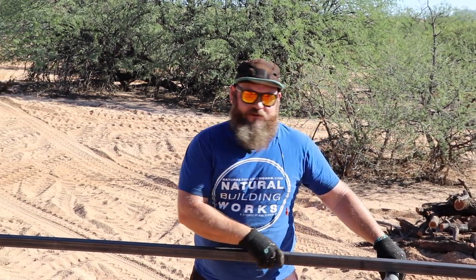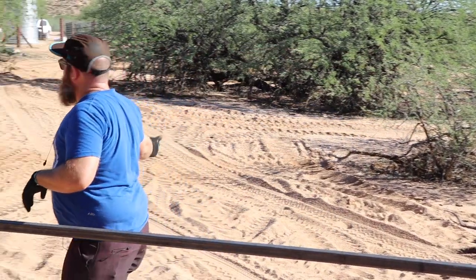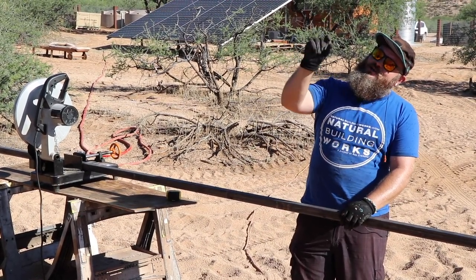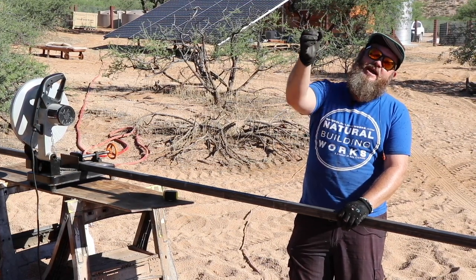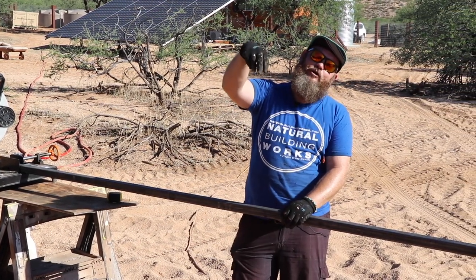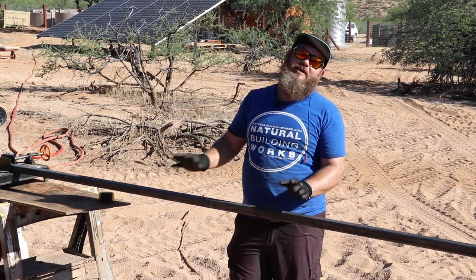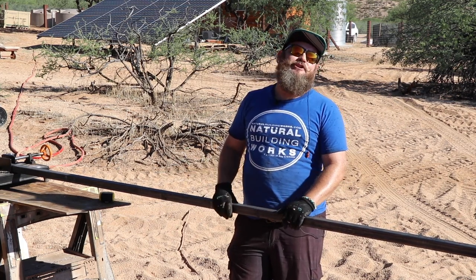Cool. Like if you're doing wire mesh, you can actually create wire. You'll see on these grids, sometimes you'll be off by 1/4 inch or something's out of level. So you're actually able to make it into the same exact gauge by just continually welding to it and letting off of the trigger. So you're making like an icicle of metal. That's just aesthetics, pure aesthetics. You know, you don't want to do that for some giant beam that you're laying up at all. But otherwise, you can fill it in. It's like a 3D printer. Pretty cool.